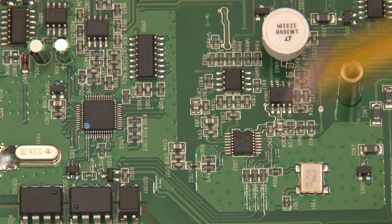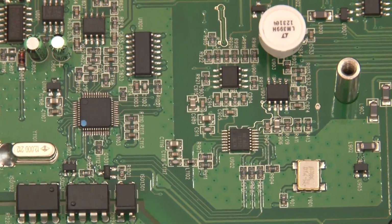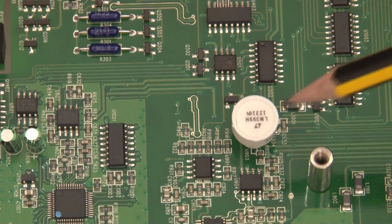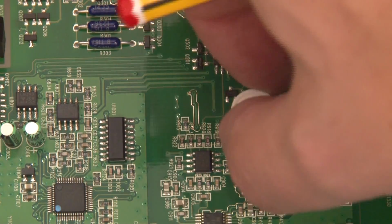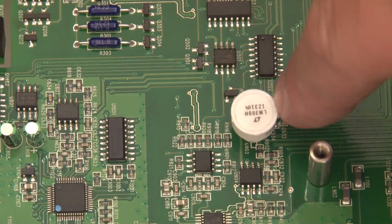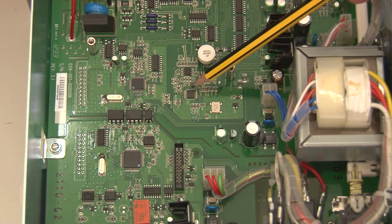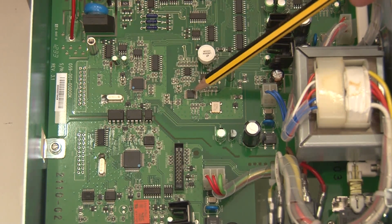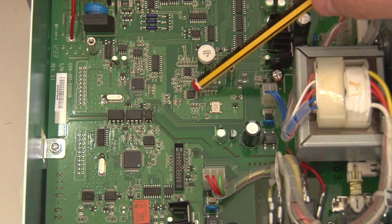There's a lot of discrete logic chips and op amps, obviously analog circuitry. There's the now world famous LM399 voltage reference here with the temperature oven or temperature jacket, whatever you want to call it. Yeah, it's an ADS1271. It's 105,000 samples a second, 24-bit Delta Sigma ADC made by Burr Brown Texas Instruments. A very nice converter that is.